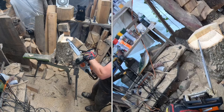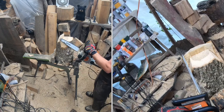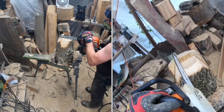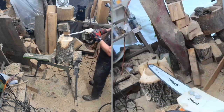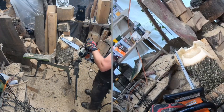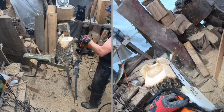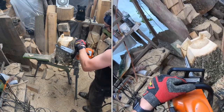We didn't quite hit our mark there — that's okay, we'll come in from the side, go a little bit deeper, and remove that piece. Jump to the other side and do the same. Lopping off the corners for the ears, then we're going to come into the center of the ears — angle the saw in a little bit and use the nose. These things do take practice. Have great control and a good grip on your saw — you can deal with kickback at any time because we're using a lot of the nose of the bar, and that's when kickback happens most.